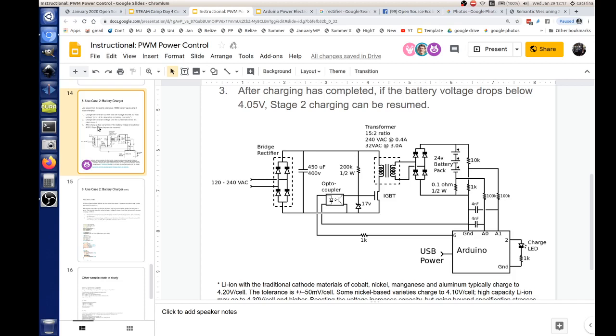It'll work to some level, but you're going to end up with some batteries getting more charge than others. But not in the limit of time. If you give it enough time, they'll all get charged up just about equally, right? But at that point, you may as well just charge them individually. Why? Because it's safer, and the end charge time will end up being generally the same. You just have to manually go and switch them out.